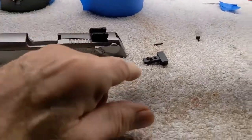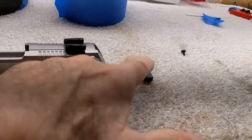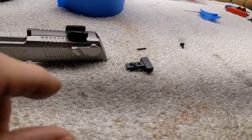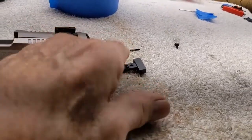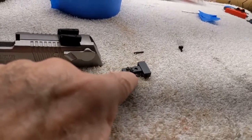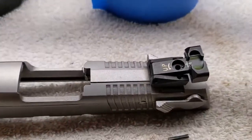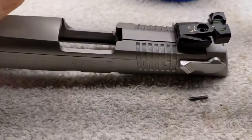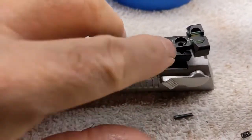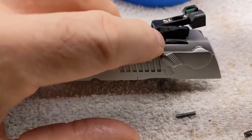Okay, so I was right. 2 springs on the bottom side of the sight, a roll pin, adjuster, and we're done. So the roll pin has to go in first, but you need to have those little springs underneath there because it'll be hard to get them in afterwards. Okay, so we got one last issue here. And then again, it comes back to the beating I had to give this sight and the fitting and everything.